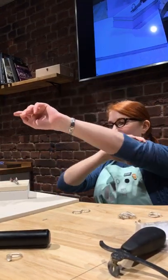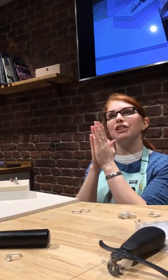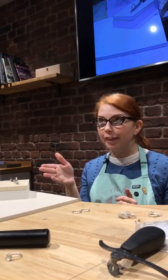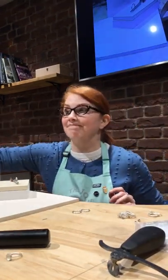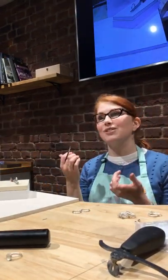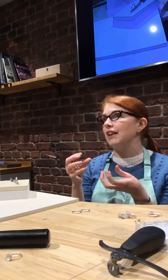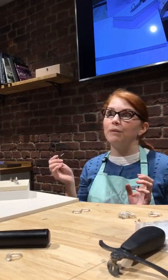Okay, so I talked about solder joints, didn't I? I'll cover solder joints in a bit more detail. The first thing you want is for it to be really tight, because if there's a gap, solder will flow onto one side and not the other. You also want your solder joint to be clean. Sawing through a joint is clean. If I left that for a month and it tarnished in that joint, it wouldn't be clean. Other things aren't clean. If you put your fingers all over it, that's not clean. So if you've been handling something that you're then going to solder, with the natural oils in your skin, clean it with washing up liquid.